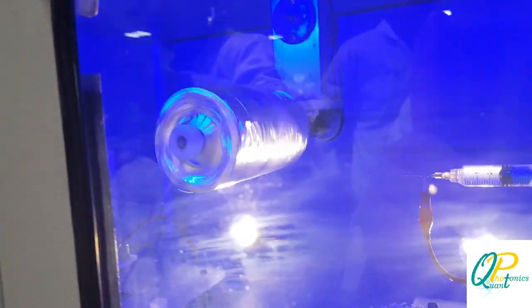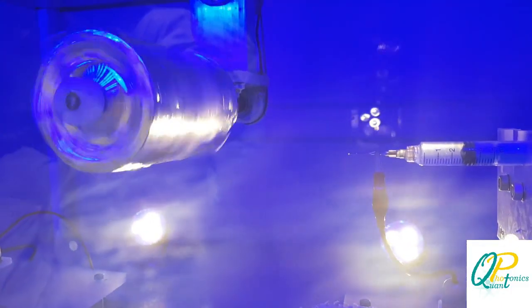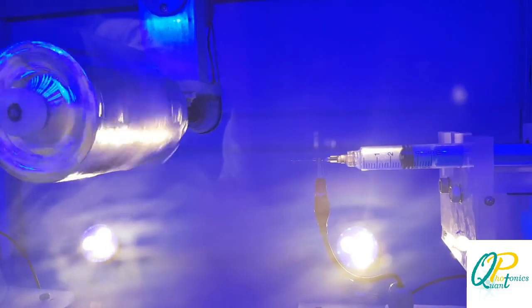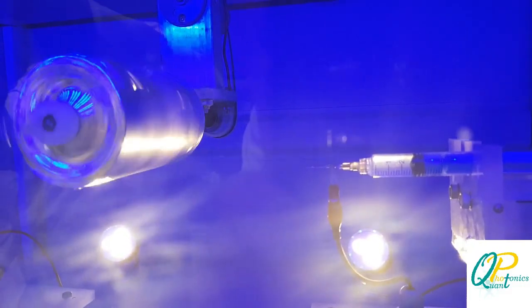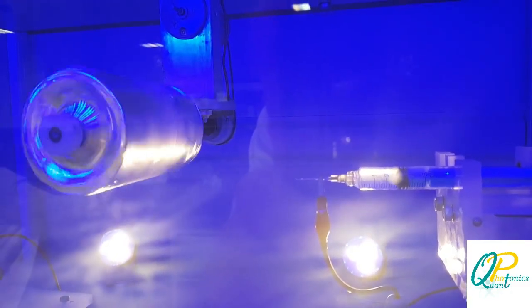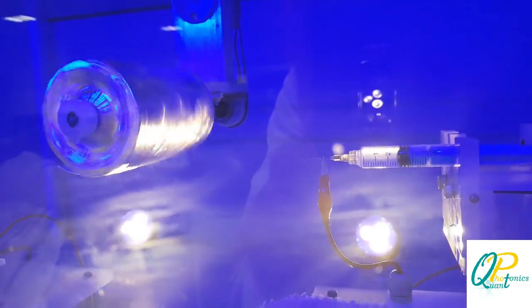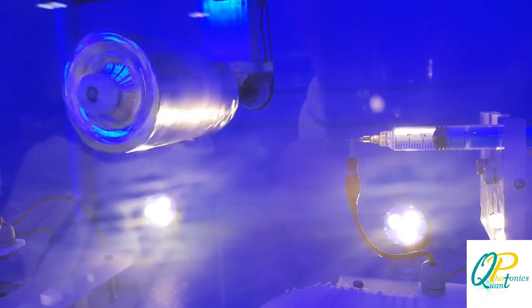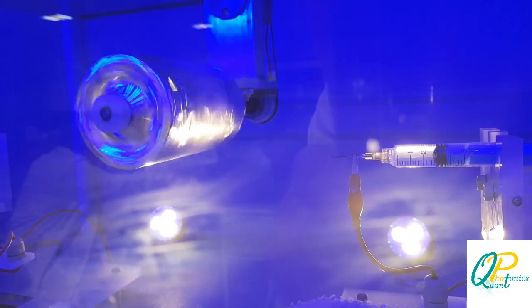The collector rotates continuously and collects the material. It is something delicate and in the nanometer order. By applying this voltage and creating the Taylor cone, we create the electrostatic force and the collector collects the nanowires from the syringe. The created nanowires will be on that foil after all.